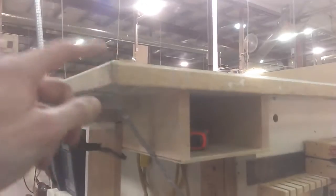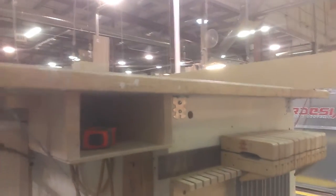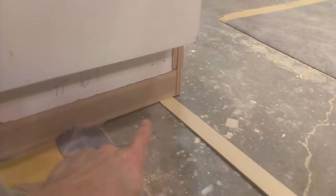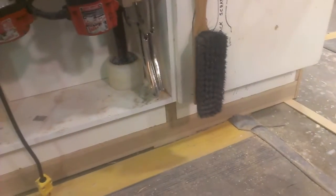On this end, I had to put the strapping in to pull this part of my table down because it naturally wanted to warp up. I also had to put a few shims in along the bottom here to help the cabinets to be level and bring the cabinets themselves into line.